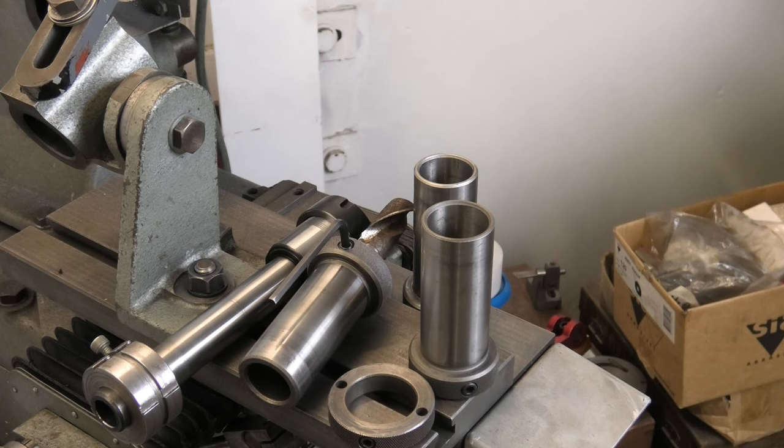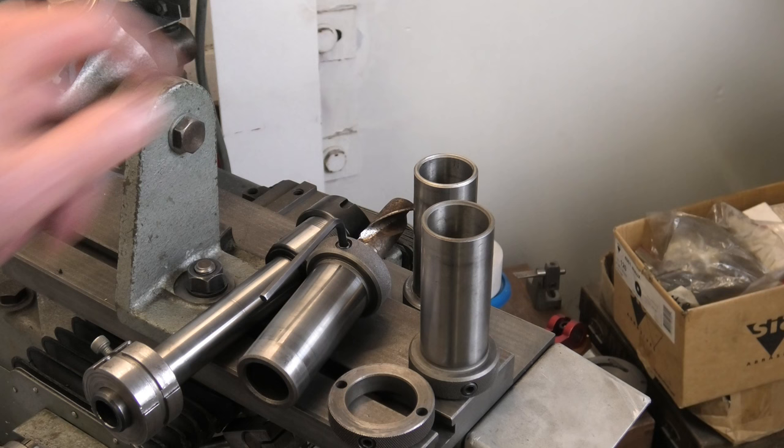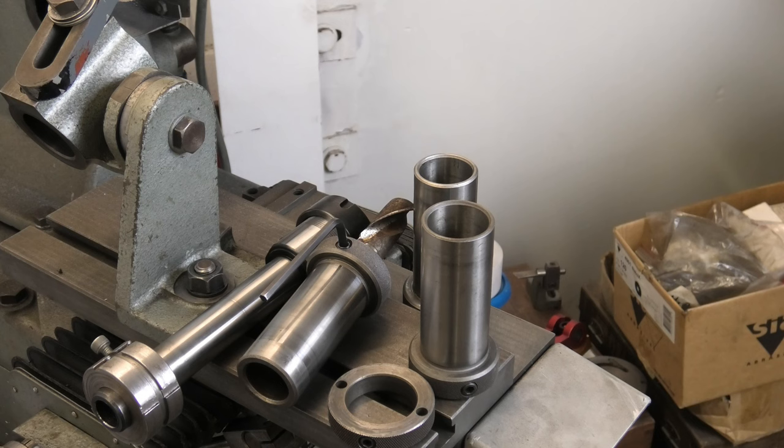By shortening up and running back onto a bush straight in there, the cutter is supported by a plain section inside the body for the length of the bush, so it makes it much more rigid. Still not really what I'd prefer, but I now have the greater part of the problem solved.